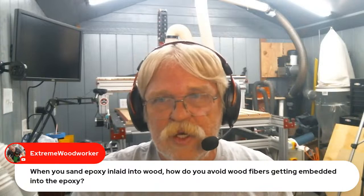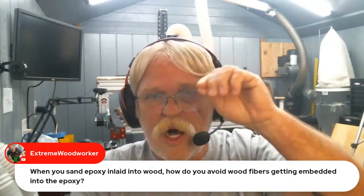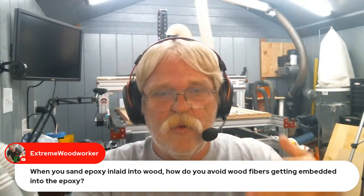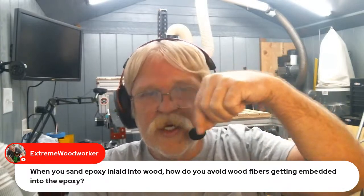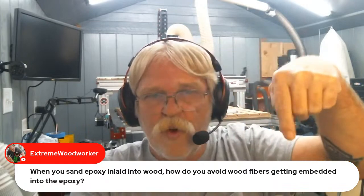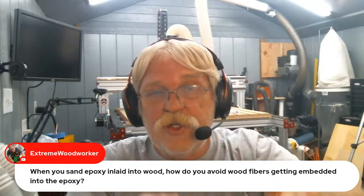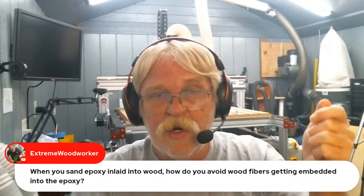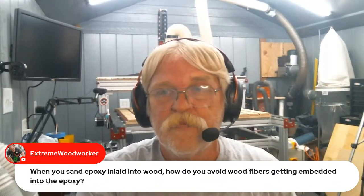One thing I didn't show in the video is that you have to go in after the carve and clean out all the chips of epoxy. The way I did that was I always run the V-carve toolpath first, and then I run the clearance path. Then I run the V-carve toolpath a second time, and that bit went around. Once there was space in there from the clearance path, those chips had someplace to go, and it cleaned right up. Then I took a stiff bristle brush and scrubbed at it a little bit, with my dust collector down there to suck it all up. That gets rid of all of the chips from the epoxy, and then you can pour and be okay.